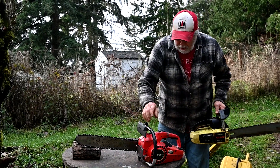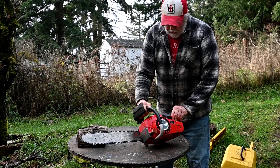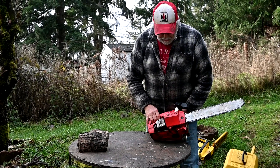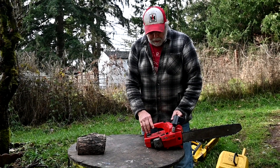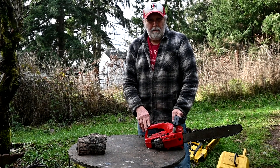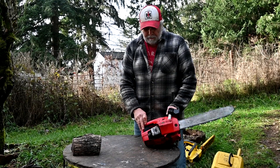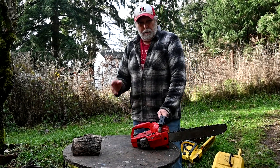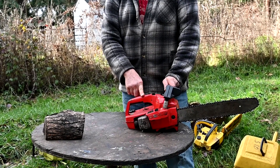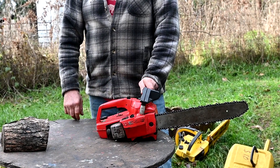Here's a bigger cousin — sold by Sears. This one is 38cc and has manual and automatic oiling, which is pretty good for a cheap low-end saw. It also had PowerSharp, which Oregon came out with at one time — a little lever so you could sharpen the chain as it went around, but it took a special chain. It was obsolete for a long time, and I see they've just reintroduced it on some crummy saws again. It was a mistake then and it's a mistake now. These little Poulans — you get a good one or you don't. I've got the smaller versions and they have very few hours on them but there's always something wrong: they don't restart or start running erratic.